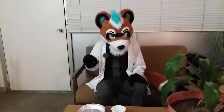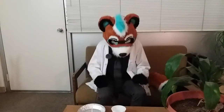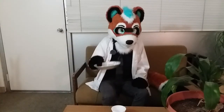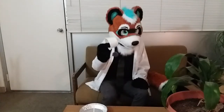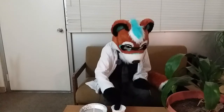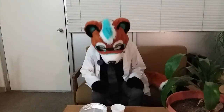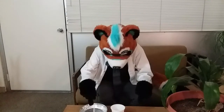So, I've just reviewed the audio files, and at close ranges, I found out that the dead cat does improve the sound, so hence that's why I'm wearing it now. At long ranges, I think the pie pan parabola did improve the sound a bit. This thing didn't work at all. It just made it worse, if anything. I'm also surprised that this little thing, the unidirectional conversion, also seemed to work really well, which is surprising. So I just thought it would make the sound more clear, but not louder. But it seems to have done that too. So I think between these two, it's really close.